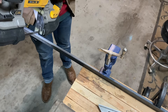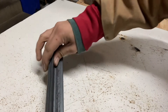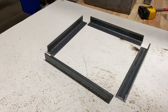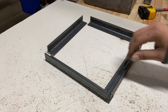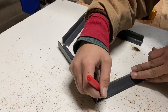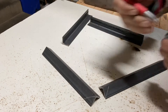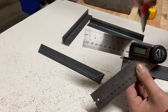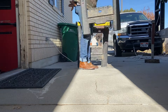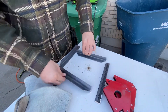I really like the aesthetic of white metal and plywood, so I'm going to use angle steel for this project and then spray-paint it to finish it up. The problem with angle steel is that the pieces can't butt up against each other if I want a flat top, so I decided to cut a miter on both ends. Miters are something I suck at cutting in wood, steel, or any material really, so they didn't turn out super clean. The nice thing about welding though is that it can fill in a lot of the gaps left by imprecise miter cuts.